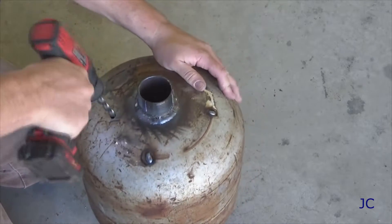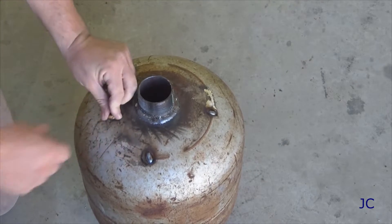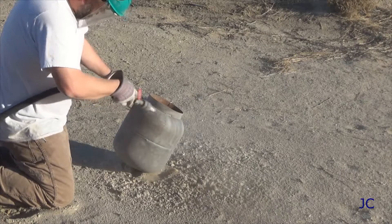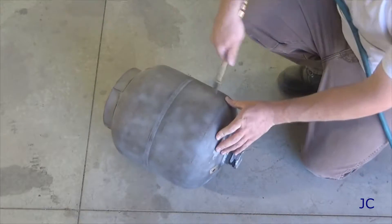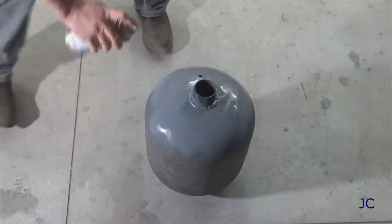When we drilled the little hole in the top of the tank earlier to let the water out, we want to go ahead and drill that hole out big enough that we can put a heavy-duty valve stem in the top of the tank. This is where we're gonna put the air in to charge the tank so we can shoot it. At this point, we're done with the metalworking portion of the project. I went ahead and sandblasted my tank - I wanted to be able to paint it and make it look pretty. You don't have to paint your tank if you don't want to. If you want it to look rusty and nasty, that is completely up to you. Do whatever makes you happy.